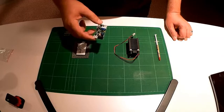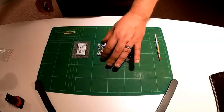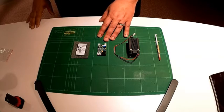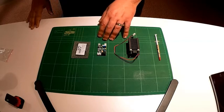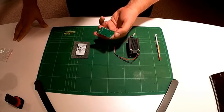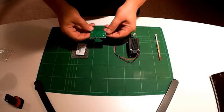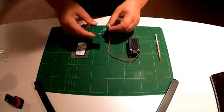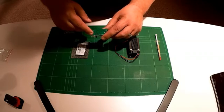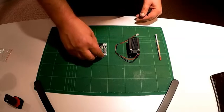It's a variable output, which is nice because once we get the laser set up, we can start it a little below 1 watt and work it up to 2 watts to see how it does. It also has outputs for pulse — basically the equivalent of pulse width modulation. So you have your inputs at 12 volts DC, a fan output which we can connect the fan to, your laser output, and your TTL, which I'm assuming is like a pulse width modulation input.